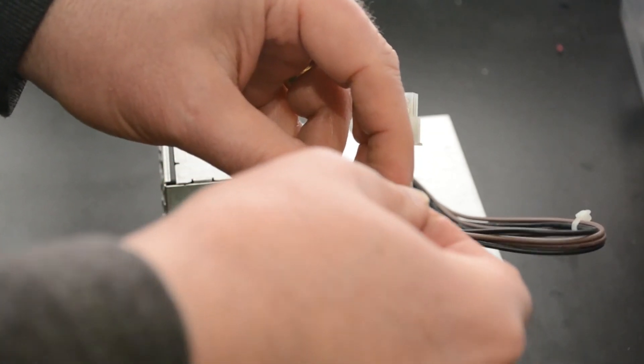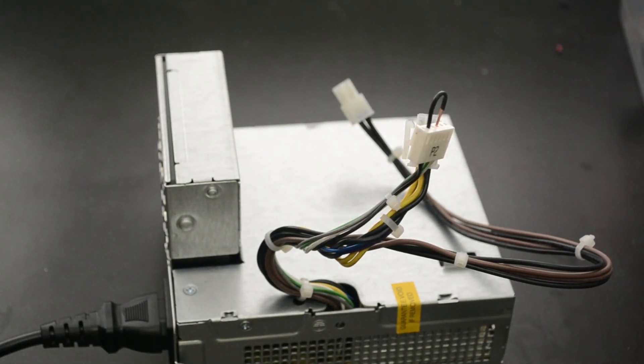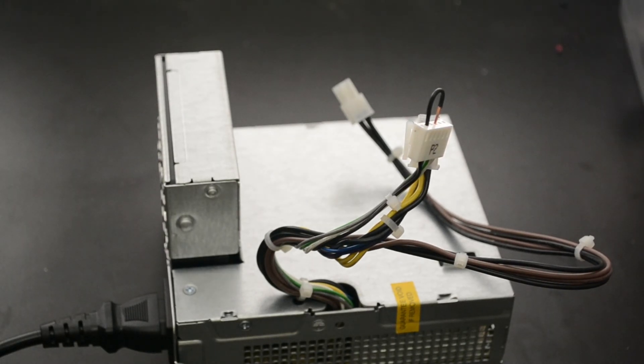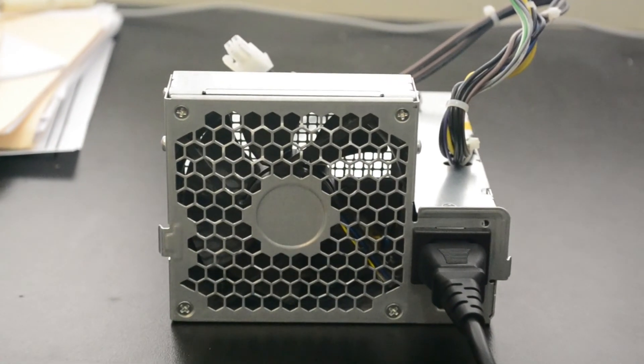Now, one of the biggest differences with these power supplies is when you fire them up, they sound like a jet ready for takeoff — that fan is a little loud. Not to worry though, there is a solution and it's relatively simple. But it does mean that we have to crack that power supply open in order to do this, because we're actually going to disconnect the fan. If you're not comfortable opening one of these things up, then stop right now and maybe look for one of those other power supplies, or put up with the fan noise. Personally, it's too loud for anything I'd want in a haunt. So let's take a look at what we have to do.